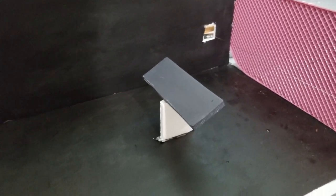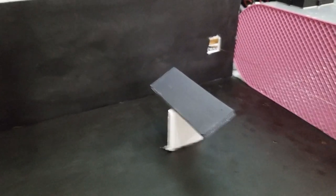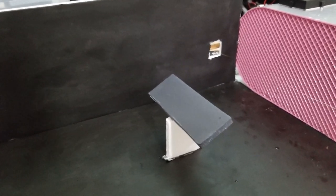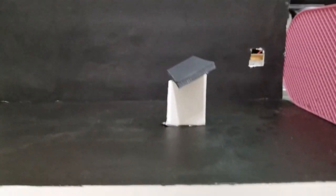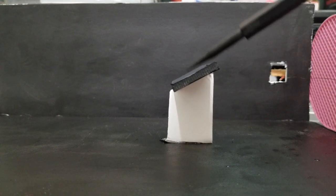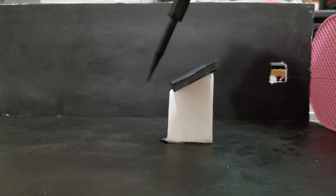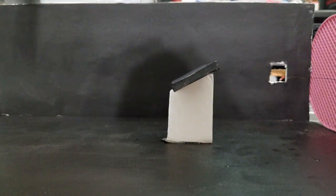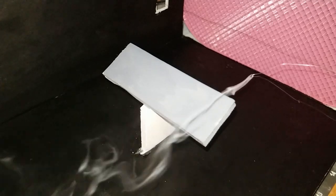I would say that the main reason I made this wind tunnel is because I'm super interested in and curious about 3D flow around wings. And so here we can see this simple rectangular wing with a pretty steep angle of attack. If we run some airflow around the tips, we can see these vortices, and that's because the bottom surface has a very high pressure. The top has a low pressure relative to the bottom surface, and so we'll see airflow spill over the wingtip and create little vortices as it travels backwards. And this is a big contributor to induced drag.